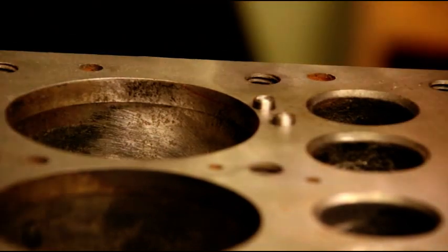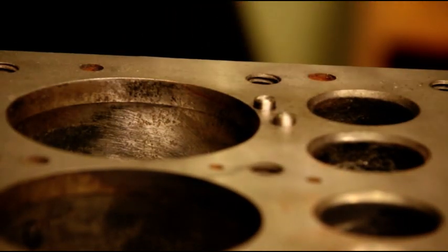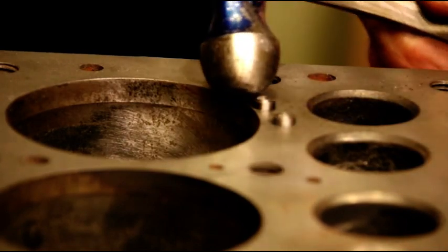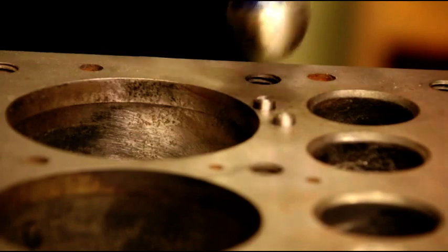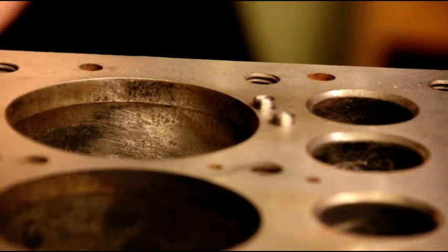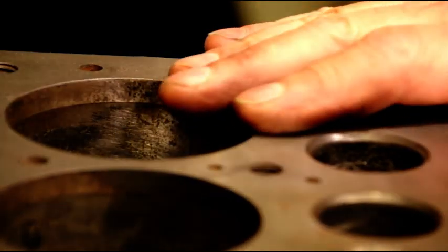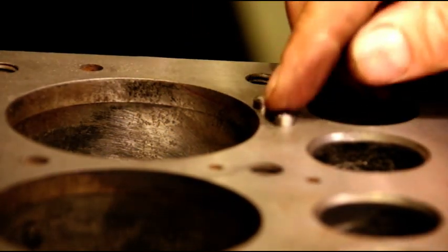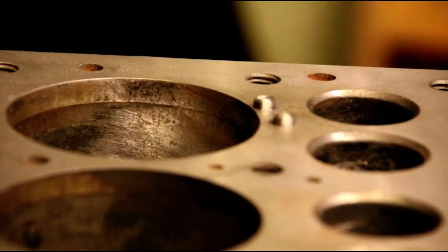And when you get them dressed down and you start peening them with your hammer, do not peen in the center. Just on the edges. Just all around the edges. Don't smack it down in the center. You'll loosen up the hook threads there. So, let's dress these down, and we'll get busy on putting the next row in there.